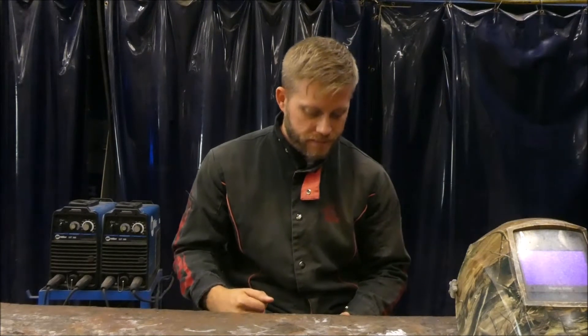It's a manual welding process that uses a STICK electrode. The pros of shielded metal arc welding are that there's no gas required. The flux creates its own atmosphere. Stick rods can burn through rust and grease. They can be used on farm equipment, are very structurally sound, can be used in wind and outside. And probably the best feature is that you can get a STICK welder pretty cheap.